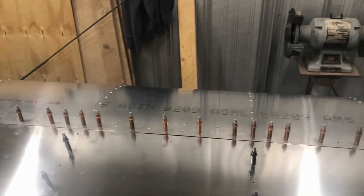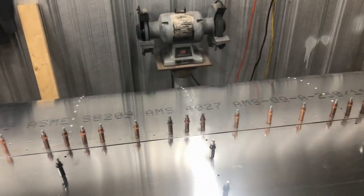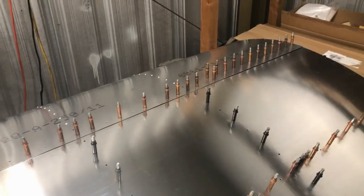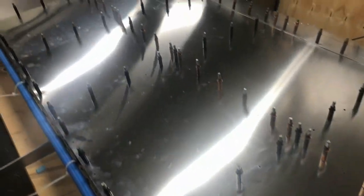If the position of the holes I drill into the spar cap is not acceptable, you could ruin the whole wing. So I maneuver my camera inside the wing and try to get some pictures of the drill holes through the spar cap. Even though the measurements are pretty precise, I just have to be sure. So here's a few pictures of the drill holes through the spar cap.